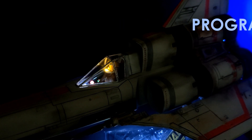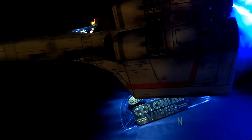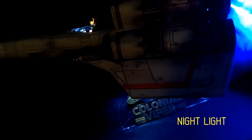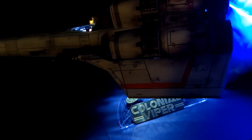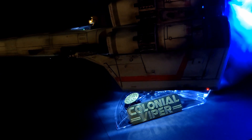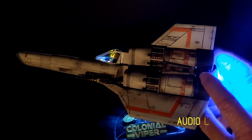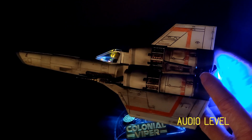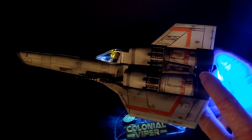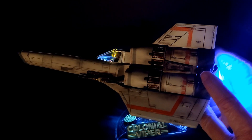There are four programming modes available: Night Light, Motion Sensor Enable/Disable, Audio Level, and Sleep Mode. The orange control LED in the cockpit flashes for the mode selected. It also indicates when the motion sensor detected movement. The nightlight level is adjustable using the programming button. Press it once and hold on that press for a high to low level adjustment, or it can also just be turned on and off using a single press and release. This setting will be stored when the power is turned off. The audio level is adjustable with the same programming button. Press three times holding on the last press and the Battlestar Galactica theme song plays while the audio level is being adjusted up and down. If you just do the three presses and release, it increments or decrements by a level of five. This setting is also stored when powered off.